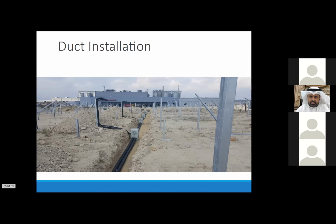I would just like to ask you a question, Andreas, with regard to maintenance and service. How, from your experience, would you prefer to have the maintenance done in the option of central inverter and the string inverters? And about the cost of maintenance as well. The cost of maintenance again is much cheaper with the multi-string inverters because, of course, any electrician can, even by himself mostly, take one inverter off and put it up again.